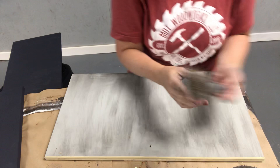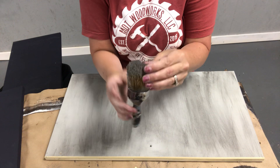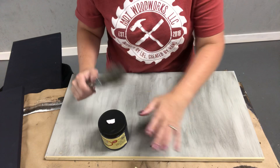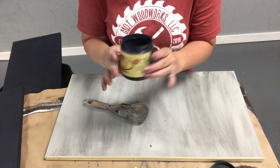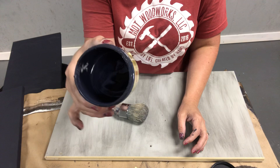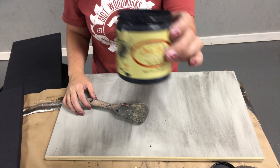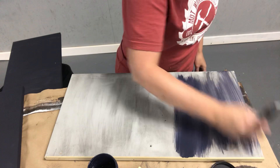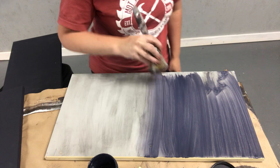Alright, I've got the hardware off. I'm going to paint with my Dixie Belle large brush which I have damp — I rinsed it out earlier. One key tip when using Dixie Belle chalk paint: make sure your brush is damp at all times. This allows the paint to glide easily over your piece, go on smoother, and extends the life of the paint. I'm going to dip directly in and brush a light layer onto the cabinet door. Make sure your first layer is super light.